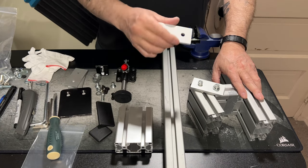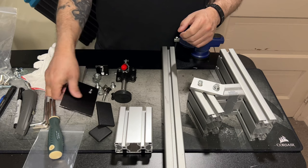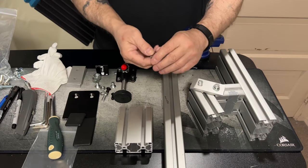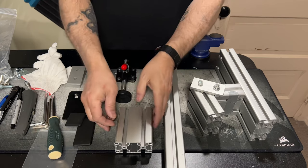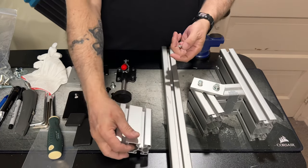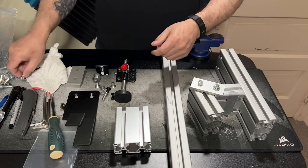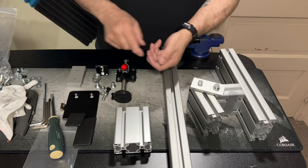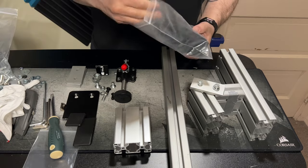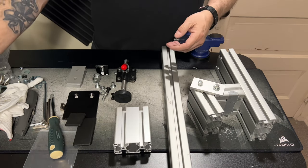You're also going to need some joining brackets, something to hold it to the table — I had something hanging around, chopped it off, smoothed it out, and bingo, that's your top plate. You're going to need some end caps, T-bolts which look more like this actually, and these slide into these doohickeys like that. You're going to need a few different types — more or less 8mm screws or bolts, some washers, maybe some spacers if you need them, and some L-brackets. By the time you end up getting all this stuff you've already spent at least a couple hundred bucks easily.